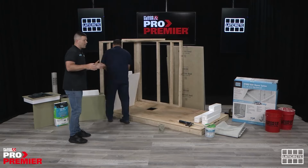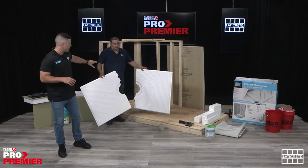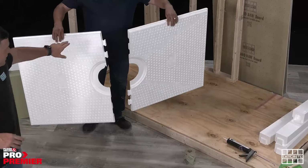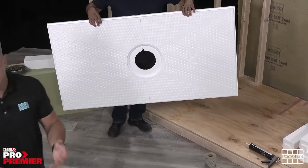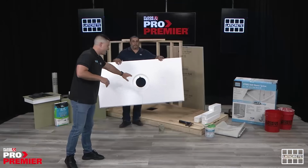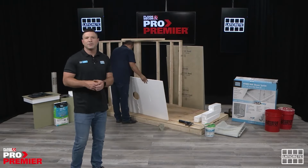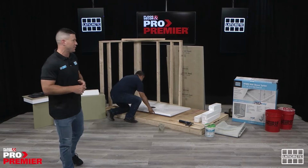So as we get started, you can see we have this mock-up shower bay. Adrian is showing off the shower pan. This is an expanded polystyrene pan. It is 3-pound density, 2-piece in nature. And what we do recommend before any installation is dry fitting the pan. So you can see we have a naked substrate right now. Adrian's gonna get started and make sure that the pan fits with the outlet that we cut out so we have a seamless installation when it's time to integrate the flange and connect to the waste outlet.